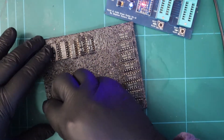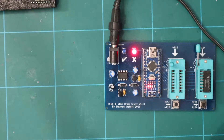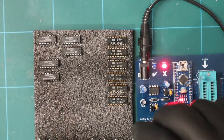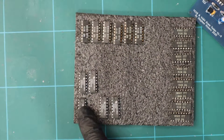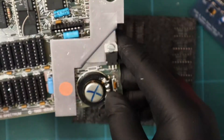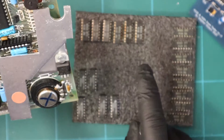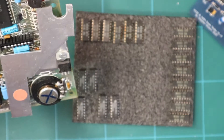These are the eight upper chips, in the order in which they came out, so bottom left is bottom left. That is a red light - that is a bad chip - and in total there were three upper memory chips which were kaput. I'll show you which ones they are: it was IC17, IC20, and IC19. I'll put it up on the screen if I've got it wrong, but there we go - three chips out of the upper memory were bad.